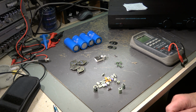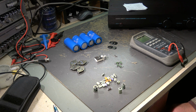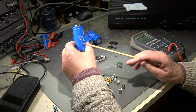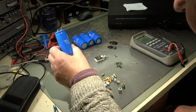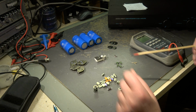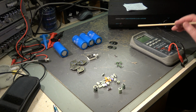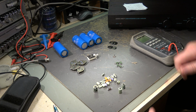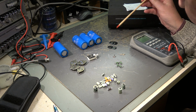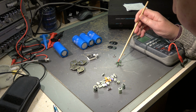And here we have the list of casualties. These are the big 4 electrolytics from the power supply. We have seen they are obviously okay, but the rated voltage is only 35 volt DC, and we have a supply voltage close to 35 volt, so I think it was a good idea to replace them by 40 volt types. 4 output transistors, 3 were bad, the switch was broken. Here the Zener diodes are replaced by bigger ones, they got hot. These are the 4 resistors, 4.7 megohm. I increased to 5.6 to reduce the bias current a little bit. These are the 4 collector resistors, 0.22 ohms. They were a little bit burned.